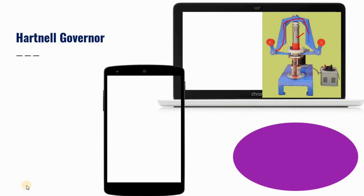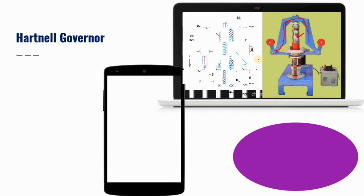In this type of governor, the balls are controlled by a spring. The frame is keyed to the spindle and rotates with it. Initially the spring is fitted in compression so that the force is applied to the sleeve. Two bell crank levers, each carrying a mass at one end and a roller at the other end, are pivoted to a pair of arms which rotate with the spindle. The roller fits into a groove in the sleeve. The roller is fixed in the horizontal arm, so the arm is called the roller arm. The spring is covered by a frame, and there is a nut on top. The sleeve has a collar on top, and the vertical shaft is named as the spindle. The vertical arm is called the ball arm.